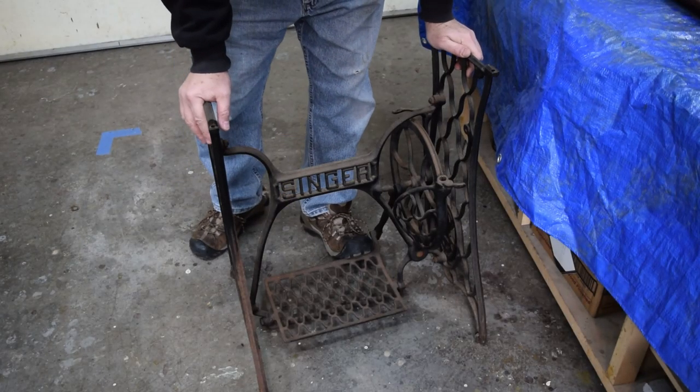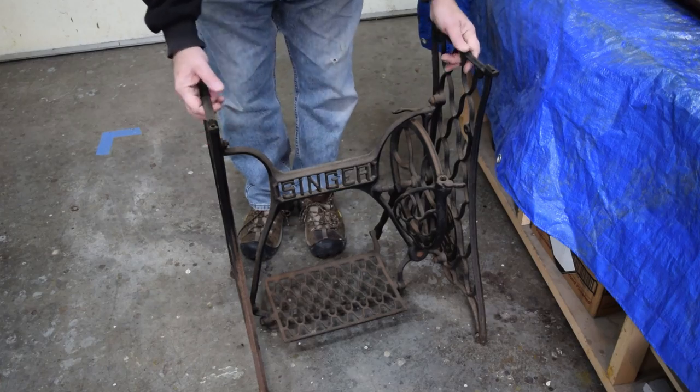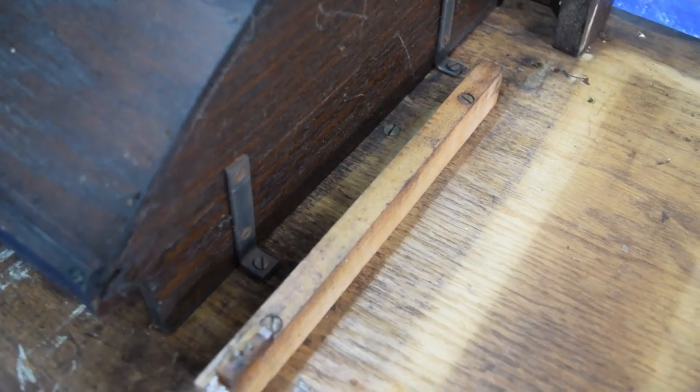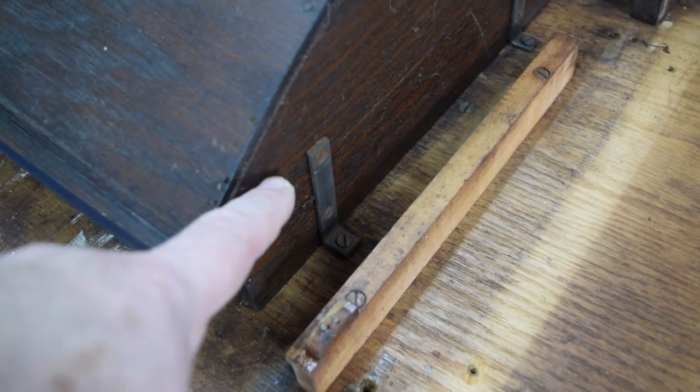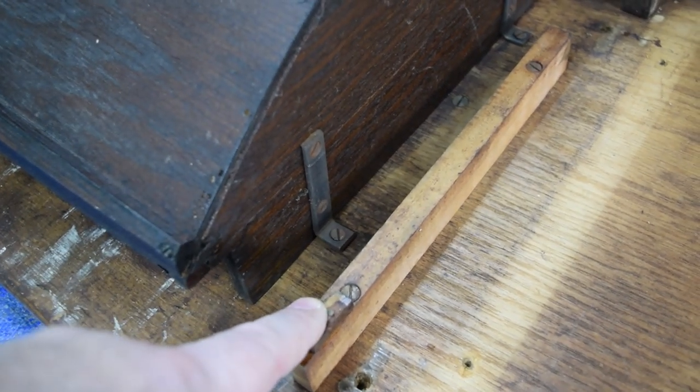And here's our cast iron base, all ready for disassembly. The cradle assembly is held on with these four L brackets. There's two screws in here and one in there. Let me get these off and we'll pull the cradle up.